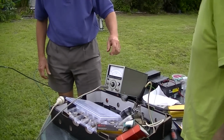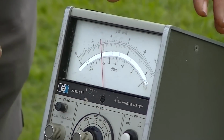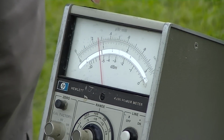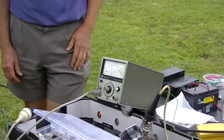Very good. Let me just get in there and look at the scale. Yeah, they're very good. The two adapters are totally resistive. That's now 10 dB extra, so that is actually minus 16 dB return loss. Yeah, that wobble was due to Quentin putting his hand in front of the slot. Cool.